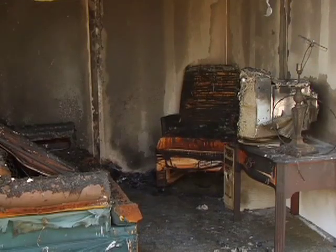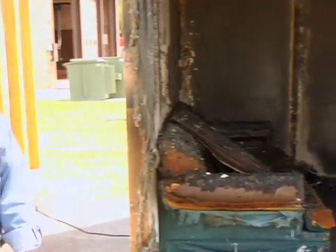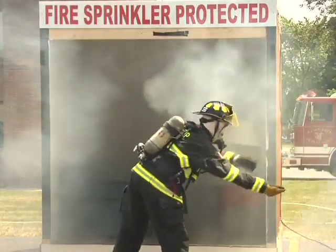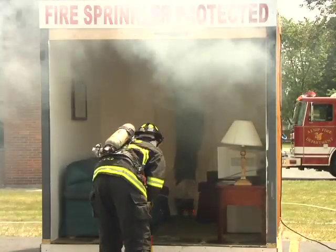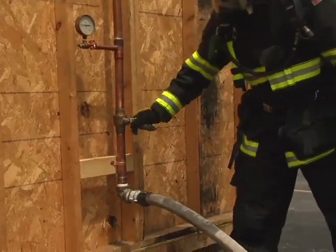Compare the time of flashover on the unprotected side to the time of sprinkler activation. Point out the differences: complete destruction on the flashover side, minimal water damage on the sprinklered side. Now this is a good point to tell the audience more about fire sprinklers, explaining how heat — not smoke — activates them. Once the fire appears to be out, have one of the firefighters remove the acrylic plastic from the sprinklered unit and use a pump can to make sure the fire is completely extinguished. Then turn off the water supply to the sprinkler system.